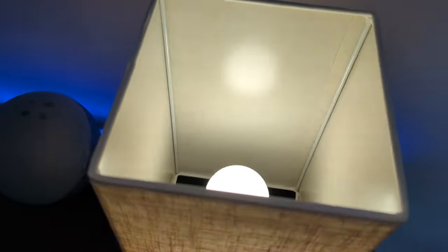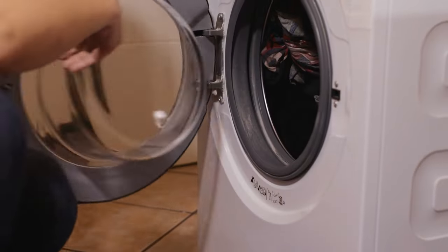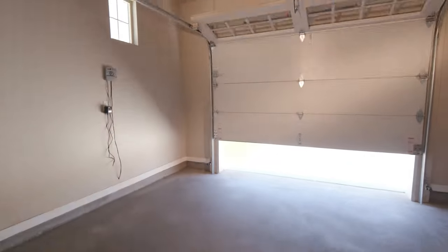As a rule of thumb, I use smart light bulbs for all my accent or mood lighting. These are usually smart LED light strips or smart light bulbs that I put into a lamp. Lamps are really great because they're cheap, they can be easily moved around, and they have toggle switches that you can just leave on and tuck behind a couch or a cupboard. Smart switches are more suited to areas where you already have a large number of existing ceiling lights controlled by a single or couple of switches, and for rooms that you don't really need fancy lighting in — like laundries, utility rooms, garages, and outdoor lighting.